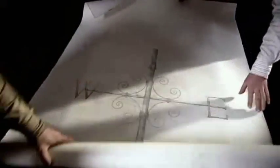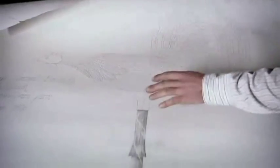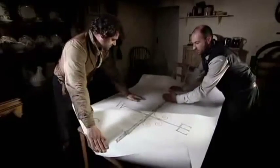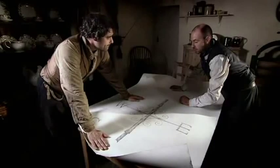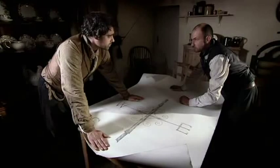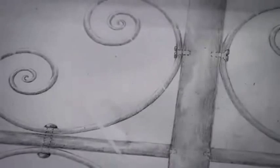Here's the final drawing then, Peter. The weather vane's progressing well, but the copper work forms only part of it. The cockerel must be attached to a support so it can rotate freely in the wind, and this is what we've got to focus on now, so we need quite a bit of iron. Some charcoal will be useful for forging the iron — it'll put some light carbon content into the iron, and also gets a really good heat, because we've got billets of iron we've got to forge right out into the section sides. So if we've got more heat in the fire, that would be ideal.